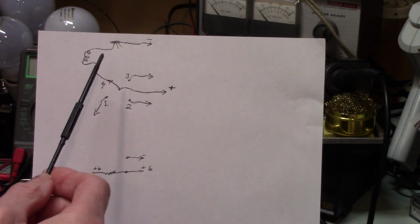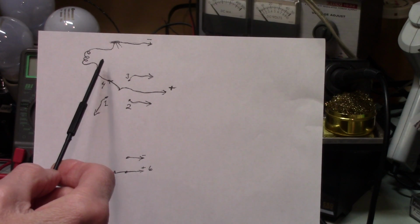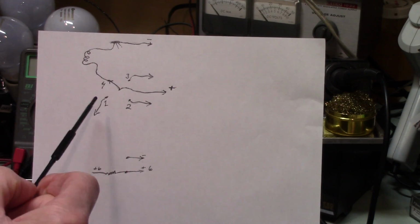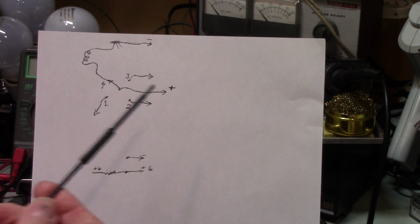And actually, I did start to pull the bulb out of the radio, out of the 8-track part, and the thought occurred to me, are you sure this bulb is bad? And I said to myself, I'm not sure. So, that's why I tested to see, and the bulb proved to be fine.